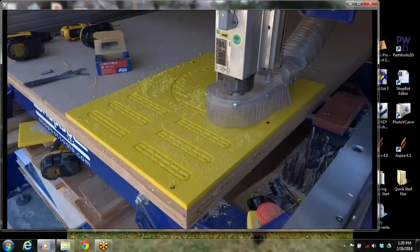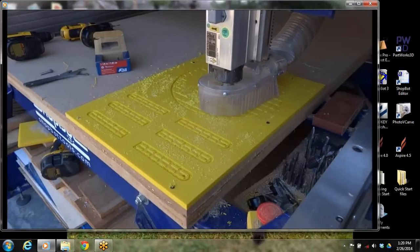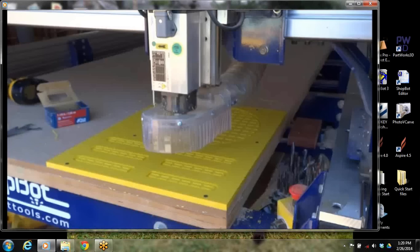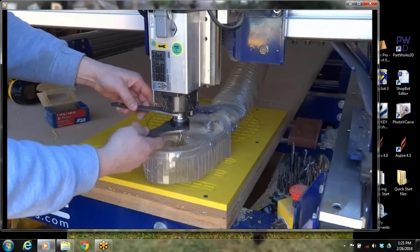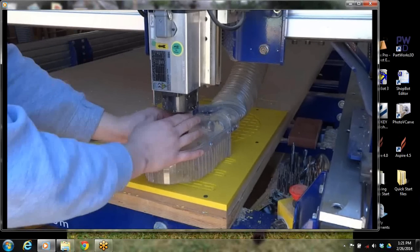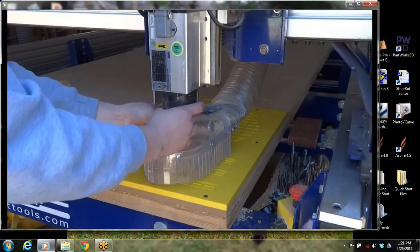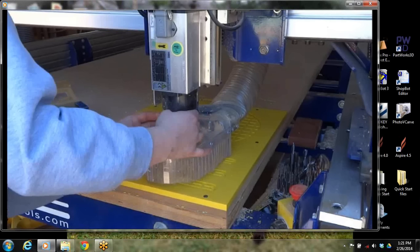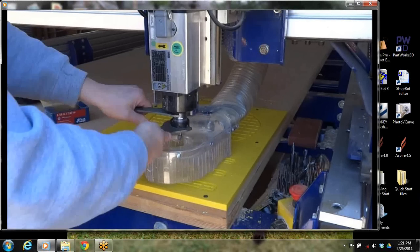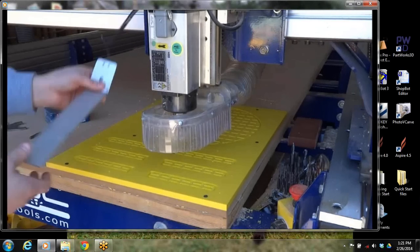So you've got your holes, your grid, and your gasketing line. Next I'm putting in a V-bit to make the layout numbers and crosshatch location marks. Notice when I take out a collet, I pull them apart, blow them out, and push them back together before twisting back onto the spindle — that's the right way to do it. It's a good way to ruin your collet if you don't put them together properly before installing.